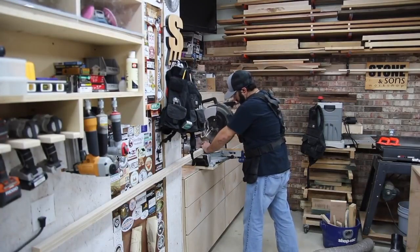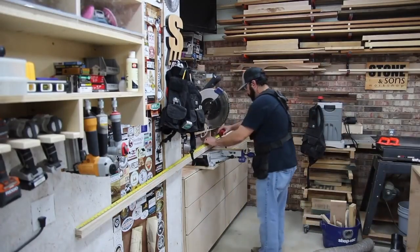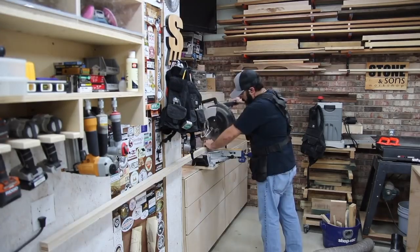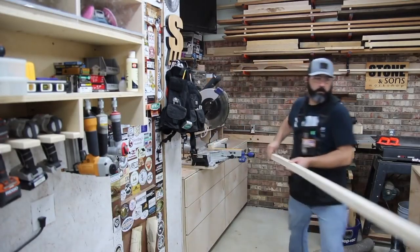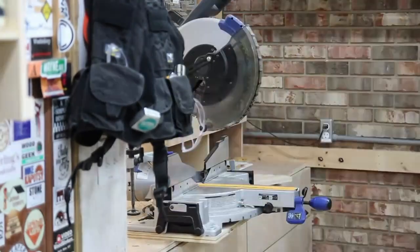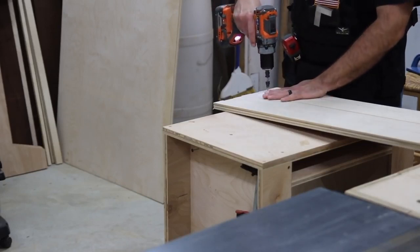With this particular style I'm making the four outside pieces — the two ends and the two sides. There are also going to be some internal parts. I've already cut down on the table saw a bunch of strips of plywood and I'm just cutting them to length. This is going to create an internal section of the bed underneath for support — kind of like where the slats are going to go, but they'll all be installed beforehand, and then there'll be a panel to go on top.